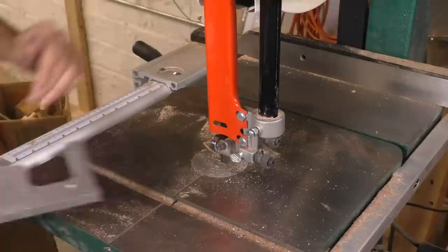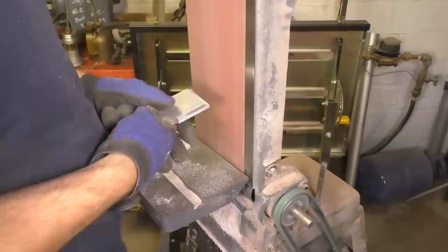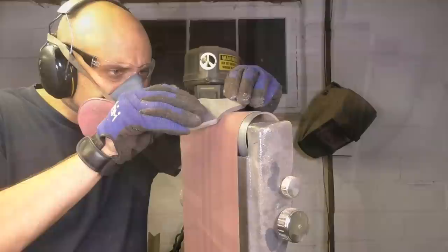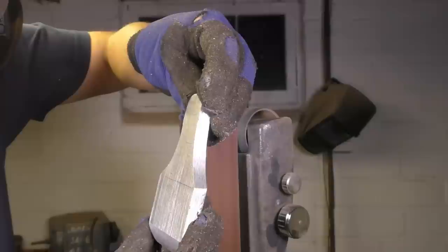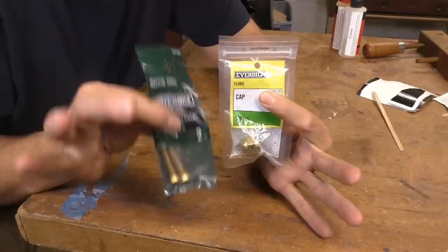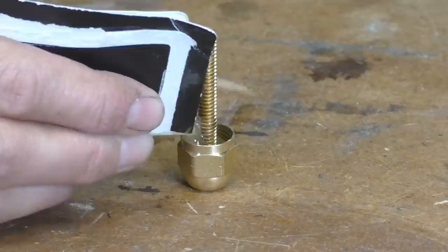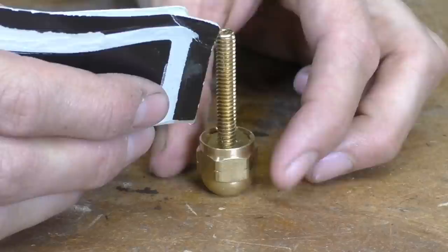After a lot of painstaking work, I'm finally in the home stretch, and what I mostly need is hardware for the plane. I'm going to make the lever cap out of this piece of aluminum plate that I just got out of a dumpster. I'll rough out the basic profile on the saw and then do most of the shaping on the belt sander. I'm also going to need a thumb screw, and I've got a quick formula: you'll need one brass pipe cap and one quarter-20 brass screw. That screw has to be brass, otherwise when you tighten it down it's going to mess up your plane iron. Just put the screw into the pipe cap, rotate it a couple times to make sure it's totally plumbed, and then fill the cap with five-minute epoxy.